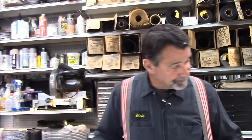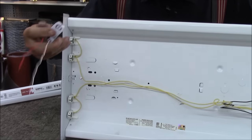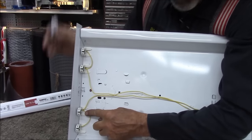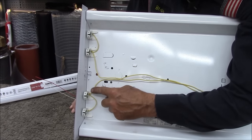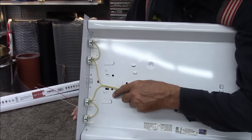There are two kinds of fluorescent fixtures. There are fluorescent fixtures that have shunted tombstones — this is a tombstone. A shunted tombstone is one that only has one wire going to it, so both poles only get one wire. This yellow wire feeds both sides of all these tombstones.